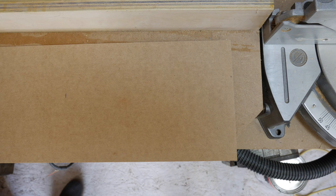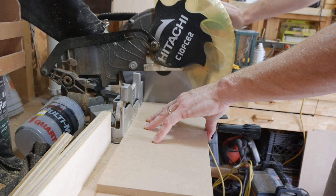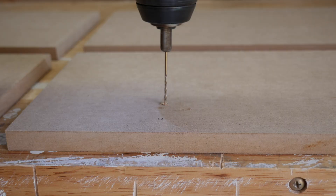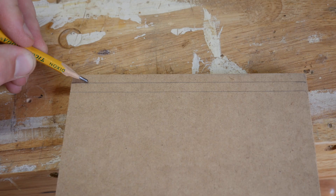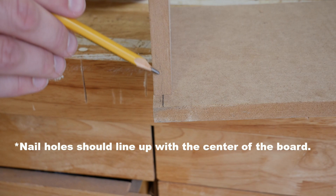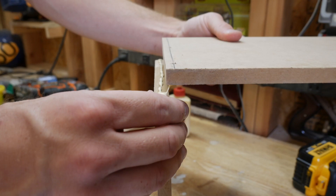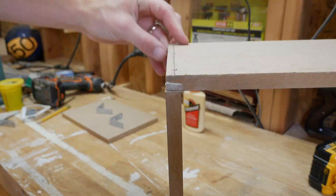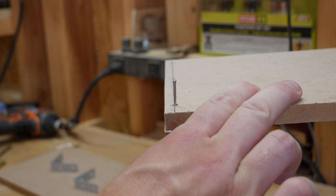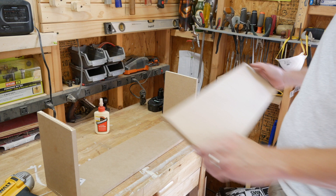If you've not read this book by Rafe Esquith, it is the truth. To cut these pieces, you could use a hand saw, a circular saw, or a table saw — I do not, however, recommend using a chainsaw. The next thing I recommend is pre-drilling your holes for these brackets; this will be harder to do later after you put your shelf together. Then mark for your nail holes — use three nails on each side to hold your shelf together. If you're going to hand nail these, it's a good idea to pre-drill MDF beforehand so that it doesn't split when you're nailing it. Then go ahead and put your glue on and prepare to fasten it together. A small hammer should work fine, and if you have a nail gun handy, go ahead and use that as well. Connect the other side by gluing it, then put your top right on and nail that in as well.